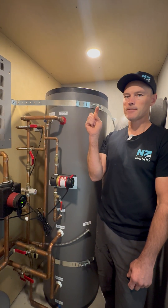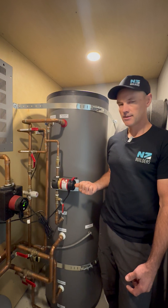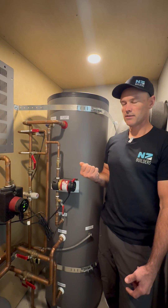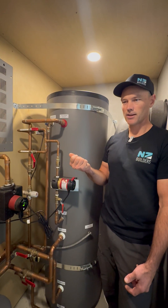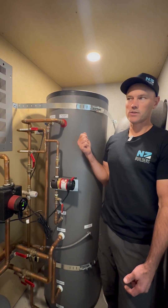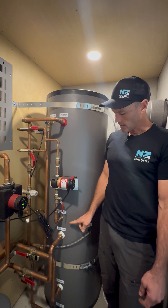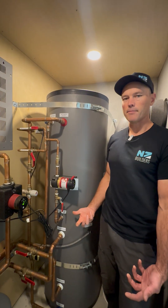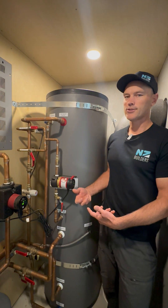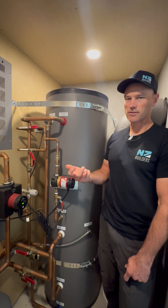Most people ask, well, I've got to pay for the power on the pump. These are run off a magnet — very, very low consumption. But if you think about it, I timed it on a house once and it was 30 seconds running cold water into your hot water tank, standing there wasting water. Although Canada's got a plethora of water, you then have to heat up that cold water that's just come into your tank. So it's actually much cheaper to run a domestic hot water pump.